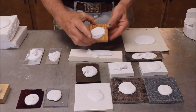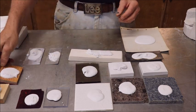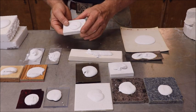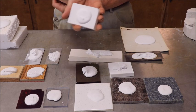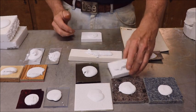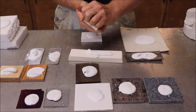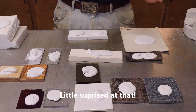A piece of laminate — it popped loose from the laminate, I knew it would. These tests are just random tests for grins and giggles. Getting a little more serious: here's a piece of plaster that I had soaked and rehydrated, and I put a dab of plaster on it — and it ain't coming loose, folks. That's how I repair plaster molds. Next is a piece of plaster that was not rehydrated, and I put new plaster on top — it stuck pretty good too. Plaster to plaster sticks pretty doggone good.